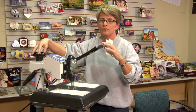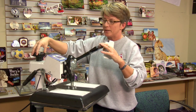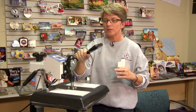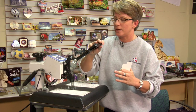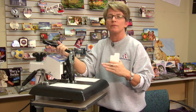That's the thing you don't want. So with adjusting pressure with the DynaSub inserts, what I recommend is that you raise the platen so that you can see the lever is upward. That's going to give you a better advantage of just having the weight of the top platen, and you don't have to snap it shut.